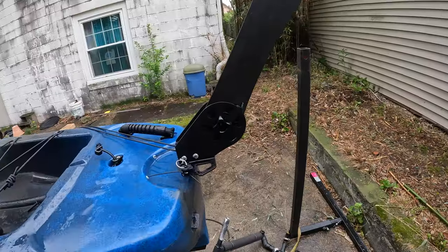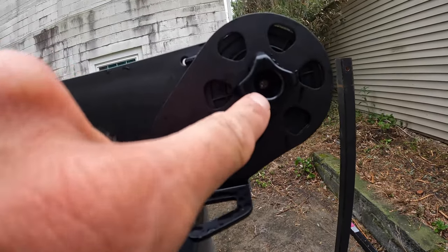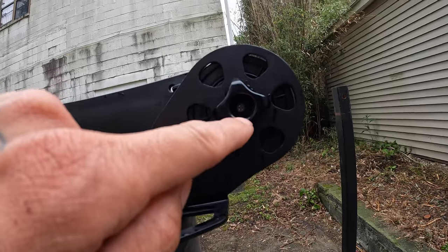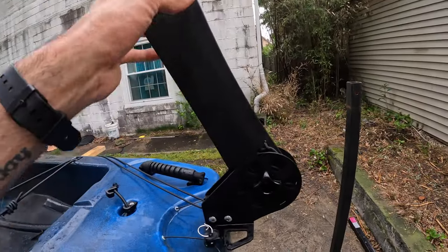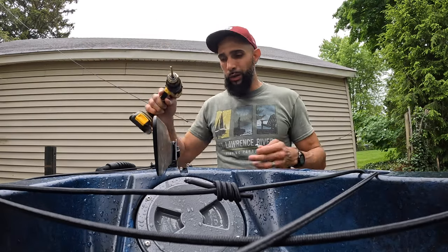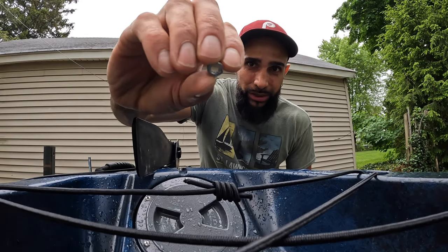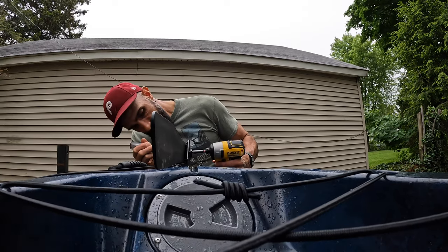On to the next issue. I demonstrated earlier how hard it is to actually operate the rudder. The first thing I'm going to do is replace this Phillips head screw with a through bolt, because I believe that Phillips head is causing a lot of unnecessary tension against the rudder itself. I'm going to use a quarter-inch bolt, and that means a quarter-inch hole going right through that original screw hole. I have a nylon lock nut, and that's what's going to allow me to tighten this bolt in there. Yet another improvement made relatively quickly that I think is going to increase the performance of this rudder system quite a bit.